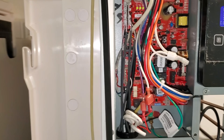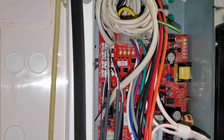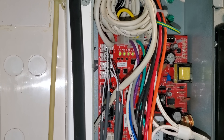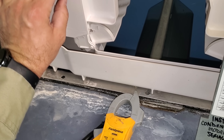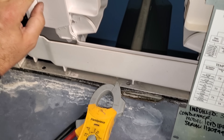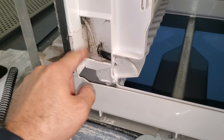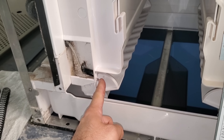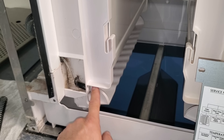We're going to switch these around. Now when I actuate the left, the left turns off; when I actuate the right, the right turns off. There's a magnetic switch right back here — it's nice and dirty, the cleaners aren't cleaning in there. There's a magnet in this curtain, and when you open it, it tells the board that the curtain — or damper — is open. That's how the machine knows when ice falls off.